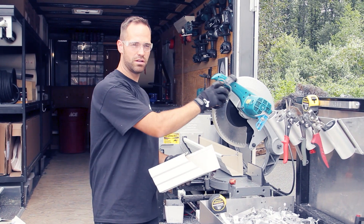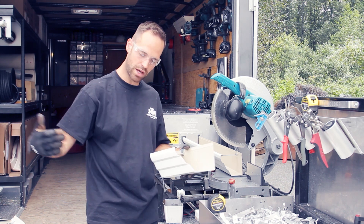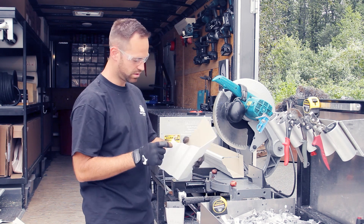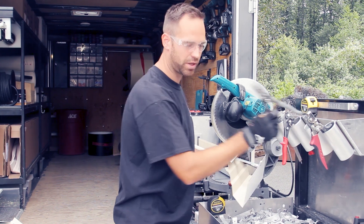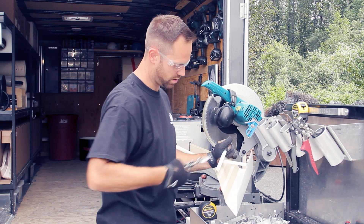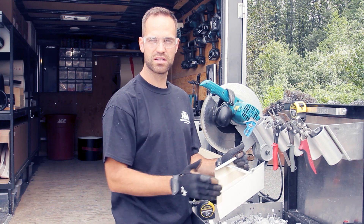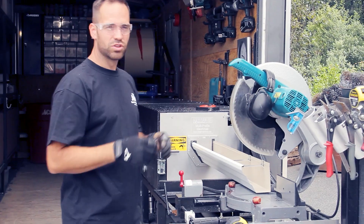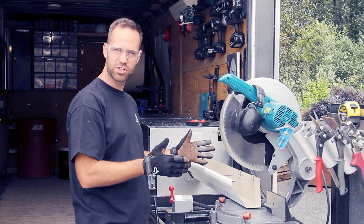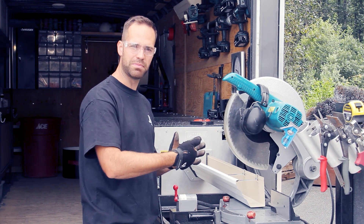The inside corners are easier. You just have to cut it straight off and then the other piece that comes in — that's the one that gets the flap. This way it's just a straight cut. Usually I just take my flat benders, flatten the top here as well, and then I take a little notch off the top just so it doesn't scratch the other material when it's sliding into this piece. Same as with your outside corners, you make your line at your measurement, go half an inch longer, make your cut on the 45 and then bend the flap in.